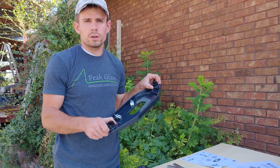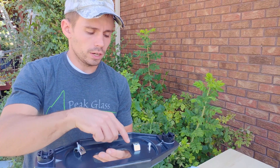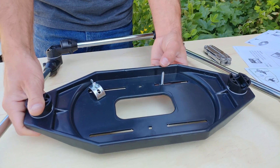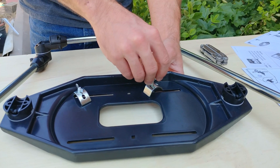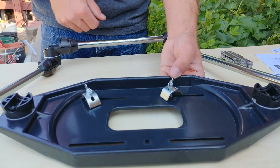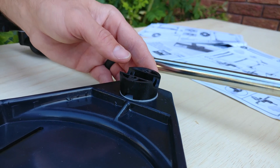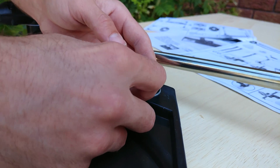This is the router tray that your router is actually going to sit in. You'll need to install the little clamps — thread the carriage bolt up through the bottom of the tray, then into the clamp, and put the wing nut on. One thing to be careful with: there are little nuts in the slots that can easily jiggle out, and sometimes it's kind of hard to align them, so just keep that in mind.